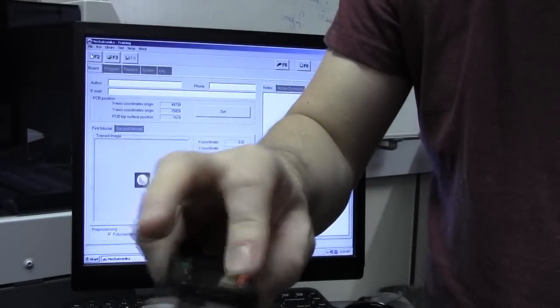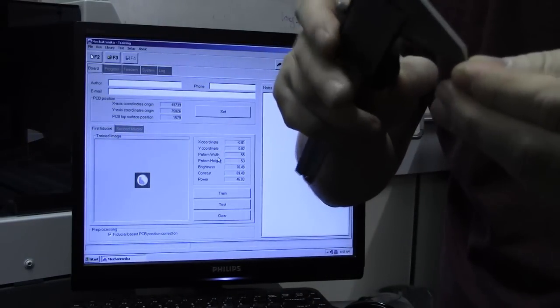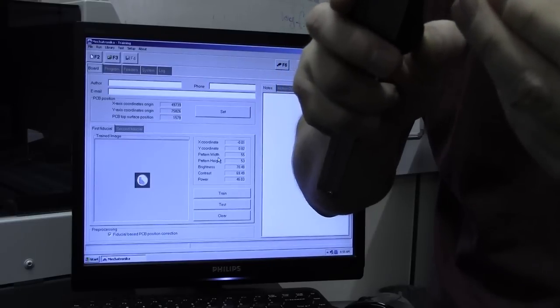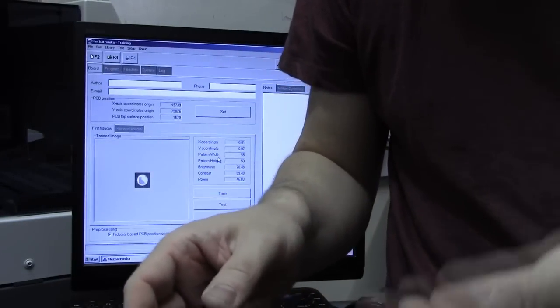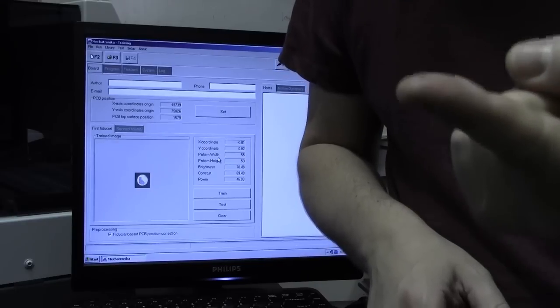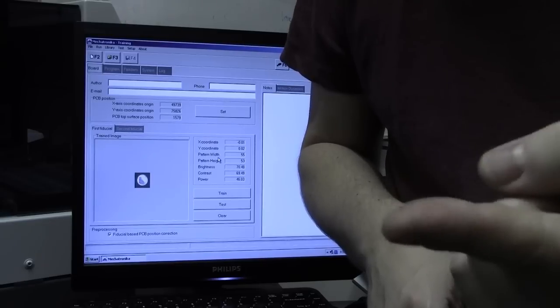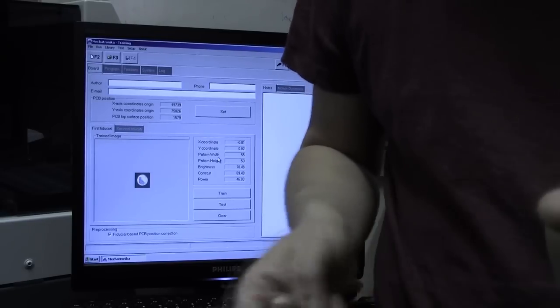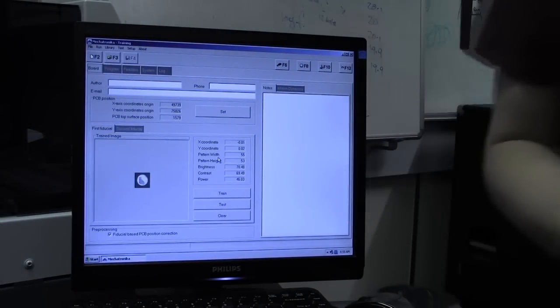So let's switch on our calipers. The height of our component is, grab hold of it. Okay, it's about 0.5mm for a 10 picofarad capacitor. Obviously, the larger the value capacitor, the higher your component is going to get if it's in the same package. If you go for a different size component, say next size up, maybe the 1206s, then again it's going to have a different height and a different width, so you're going to have to remeasure all over again. All components have different heights and sizes, so make sure that you measure it and you do note it down.